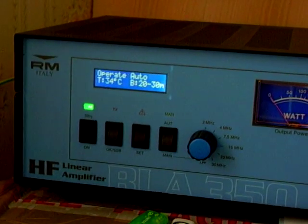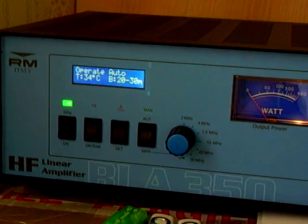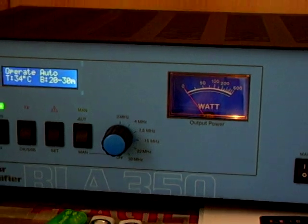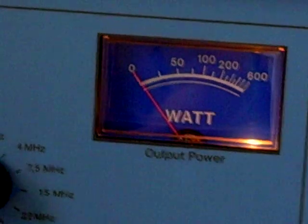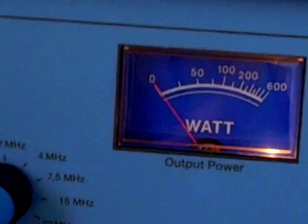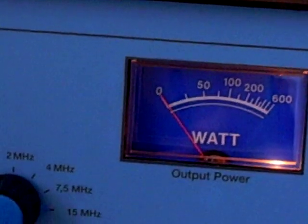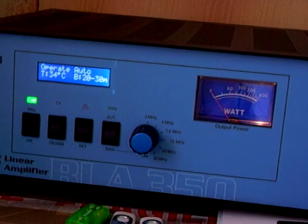If you've already got an antenna that's pre-tuned for the frequency, don't need an ATU or anything, then that's even better — you should get between 300 and 350 watts. So let's just pop in a little bit so you can just see my key up. There, you've got 300 watts. So that's 300 watts with 10 watts in, on 20 meters, with it actually tuned correctly.